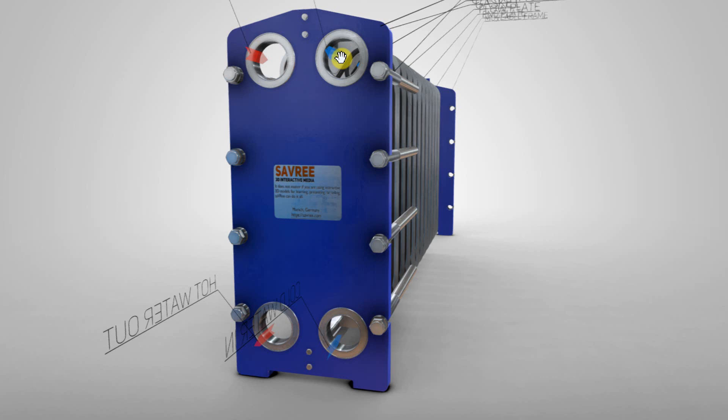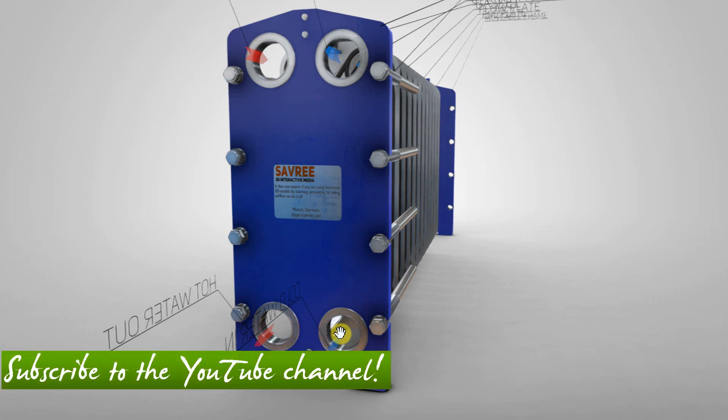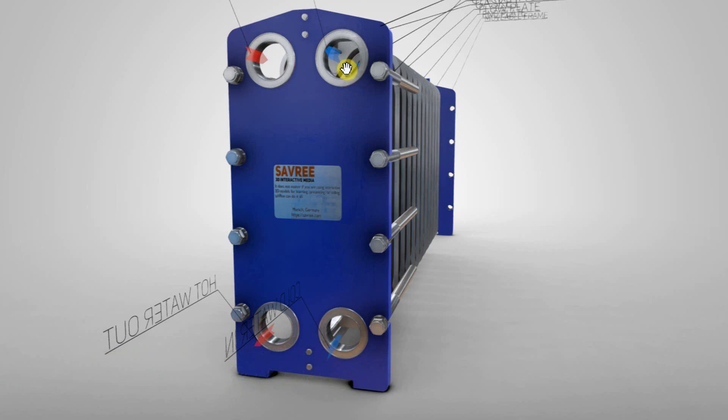The reason we feed the fluids into the heat exchanger like that is actually quite simple. As the cold fluid goes in at the bottom, it's going to pass through the heat exchanger and become warmer. As it does so, it becomes less dense and then it's going to come out of the top. When it becomes less dense, it's going to have a tendency to try and rise above any fluid that is more dense, so it's going to try and rise upwards out of the heat exchanger.